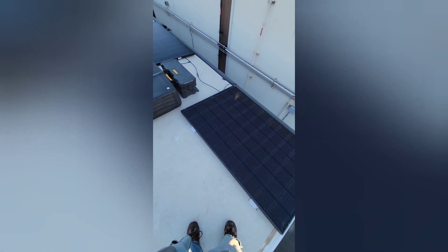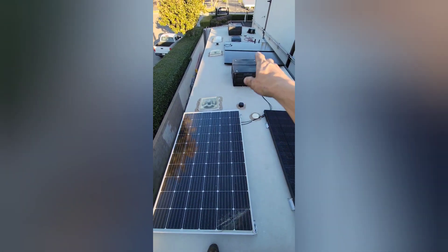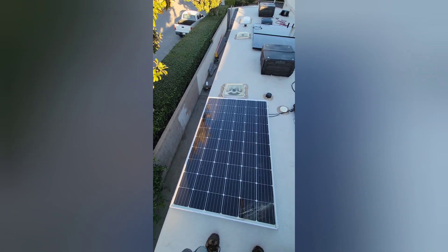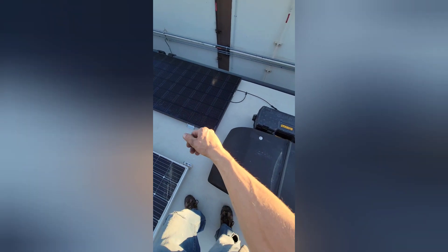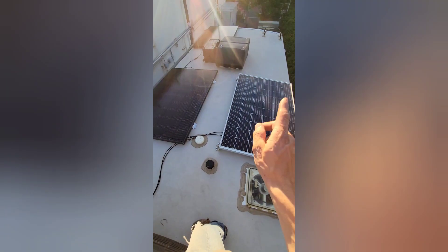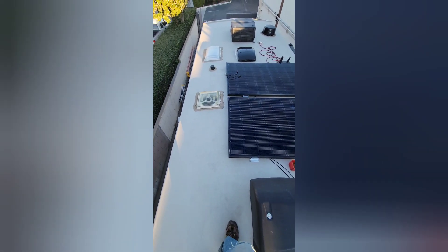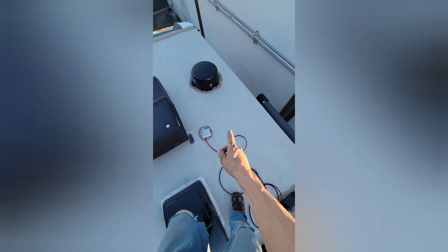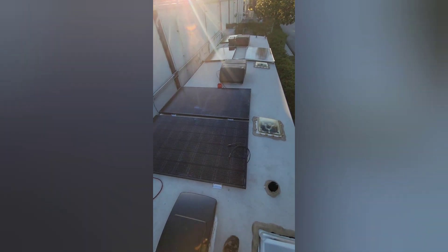Wrapping up for the day — we got the panels up on the roof. Most are screwed down; I didn't finish those two yet because I still need to fix the holes from moving the factory panel. These three are mounted. I've got this panel and this panel wired in series, and this panel and this panel in series, then those two groups come together in parallel. The factory panel is on its own solar controller — we swapped it out for a Victron, which will be much more efficient and show up on the Touch 50 screen. I forgot to grab a grommet from the RV, so I'll take care of that tomorrow. Should be able to get everything on the roof finished tomorrow.